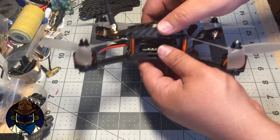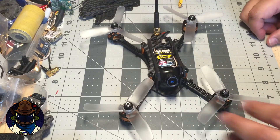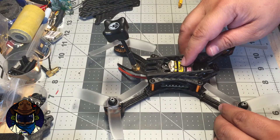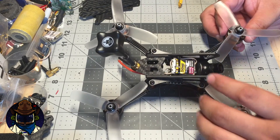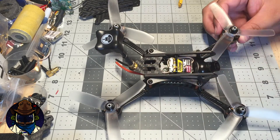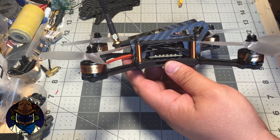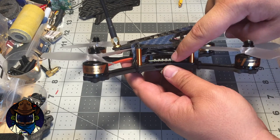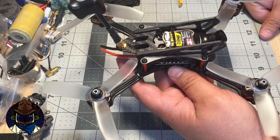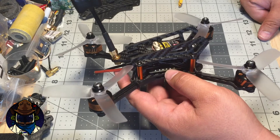I've tried to make something completely unique to Space Cowboy Drone Design. It uses a standard HS1177 camera. I switched to a slightly different type of VTX — instead of having the SMA on the VTX itself, it has a pigtail extension to the back. The other thing that's notable about this frame compared to my other designs is that it's designed for a 4-in-1 ESC, so you're not putting ESCs on the arms — you just run the motor wires into the center of the frame.